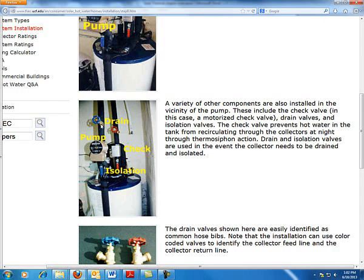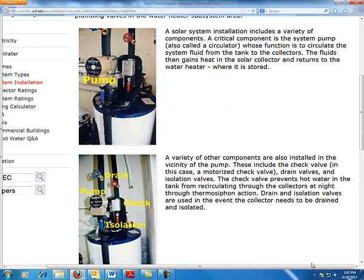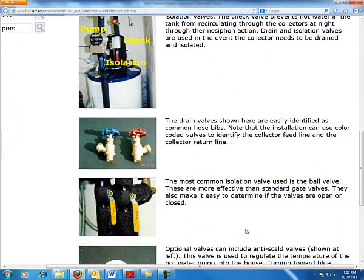Unfortunately, pumps are one of those things that will eventually go bad — that's just the way life is. So we always want isolation valves and we always want drain valves. For drain valve situations, it's not a big deal to use a regular globe valve or a gate valve. But most times when we do isolations or valving, it's better practice and more efficient to use ball valves.